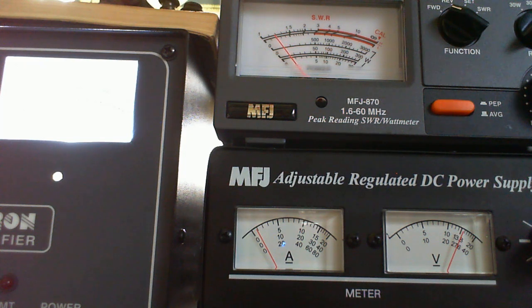Now I'm going to increase my transceiver power to 65 watts. We're somewhere between 300 and 400 watts. Let me read the grid and the plate — the plate current's at 350, and the grid is right over 50. We're still well within the parameters for the amp.